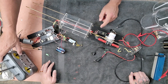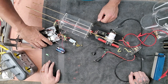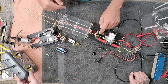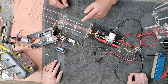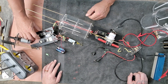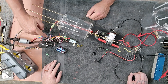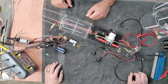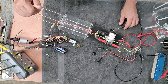All right, our servos have power now. Pitch controller's working. Servos working. Those aren't going to work because they don't have power — I just powered up the receiver directly. What I'm thinking is that the battery eliminator component in the speed controller is shot and it's not providing power to the receiver. So we're going to need to install a BEC, which we should do anyway.